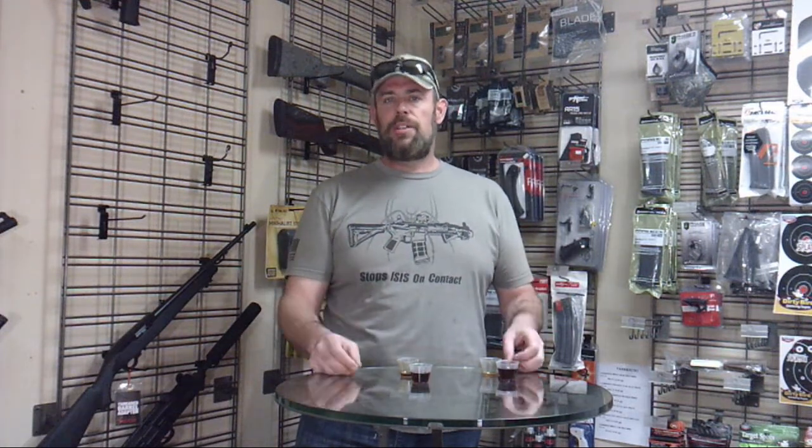Too hot or too cold, it's going to impact your spraying. Your sweet spot is somewhere between 65 and 85 degrees — that's where, ideally, you're going to want to spray. Higher humidity, you're going to have a little bit of a different spray temperature. Lower humidity, you're also going to have a different spray temperature. Humidity in your environment — everything plays into a role when it comes down to spraying. Just remember that. There are some key tips. Have a good one.